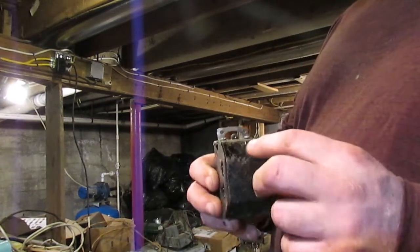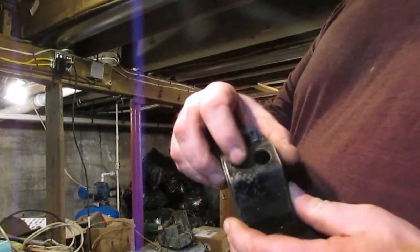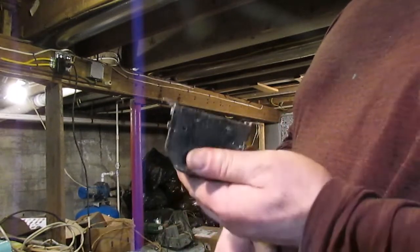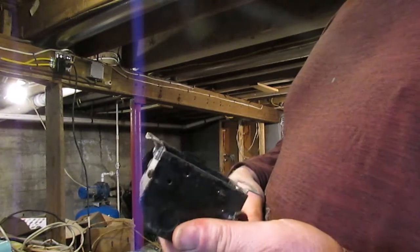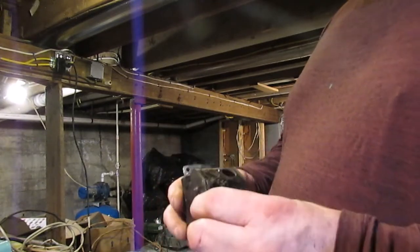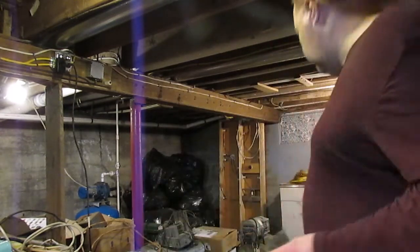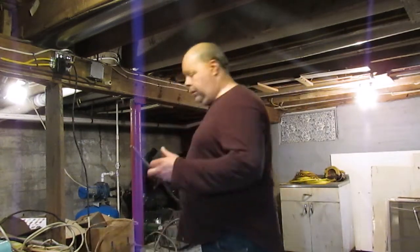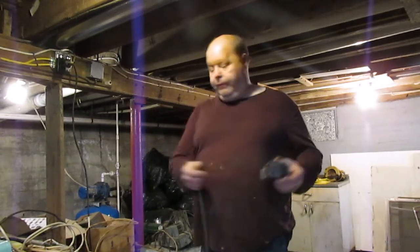There was this knob and tube switch box. Obviously they have two separate small knockouts, and you can't put any of the new modern Romex connectors in these, so effectively that makes these boxes obsolete, which is too bad because they're a nice quality box. They're nice and strong, but this one I believe was used with this Greenfield cable originally, because that would have actually been able to go in there too.